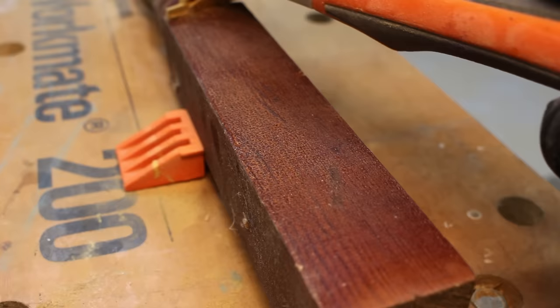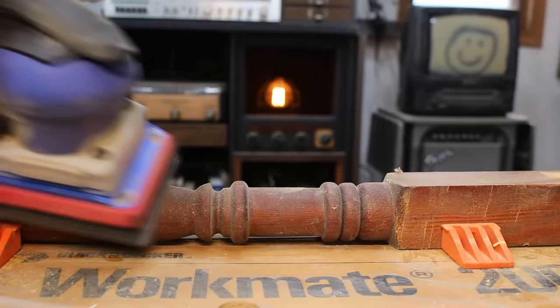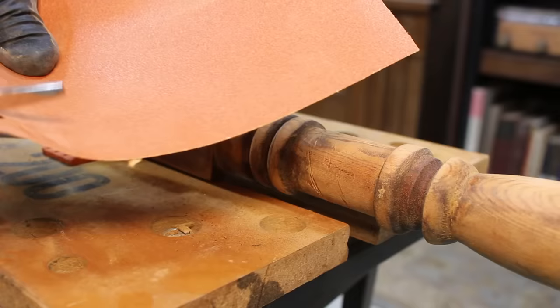Once again, I'll scrape as much of the old finishes as possible using the carbide scraper. I'll then use the surf prep sander with the sponge-like pad. This is the perfect practice piece to try these steps without worrying about causing too much damage. Sanding the detailed areas with this surf prep sander will not yield perfection, but this is one of the main reasons why I was interested in this specific sander.